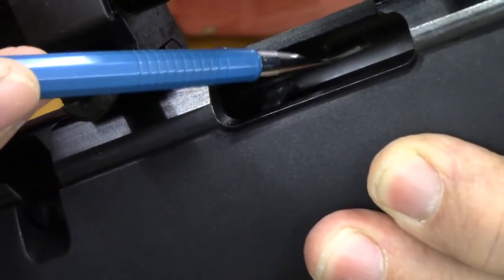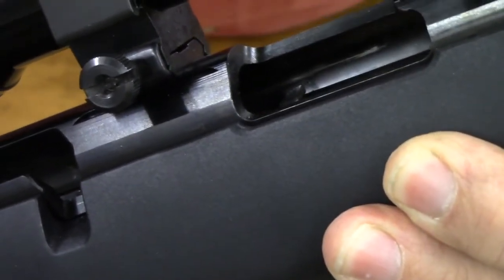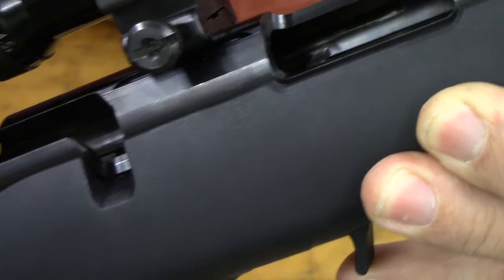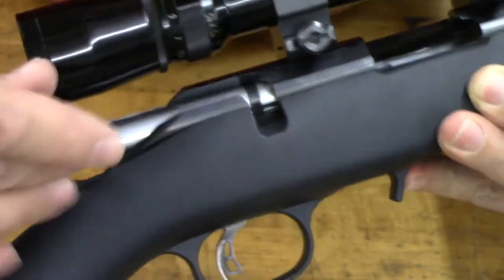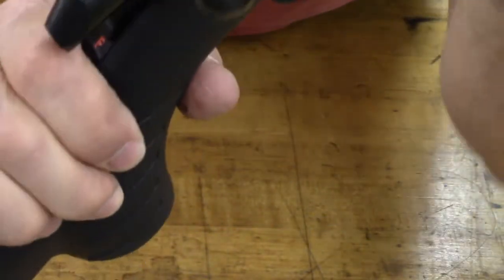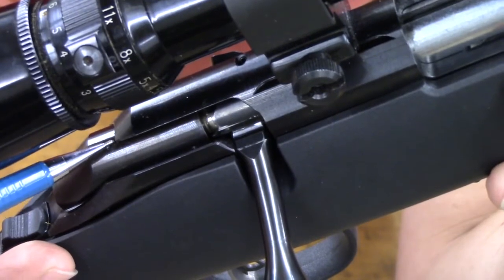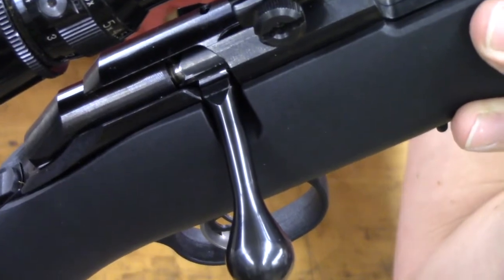You see in here where the shiny spot is — in just a few hundred rounds I've worn through the blue, and I've got a deep enough scratch inside of my receiver that I can catch a fingernail on there. I'm going to take care of that. The part in the shroud that I showed you corresponds to the very back of the receiver right there. So I'm going to lightly stone the inside of that receiver and take out any burrs that I can find.